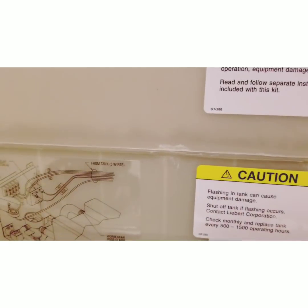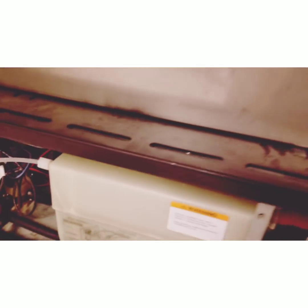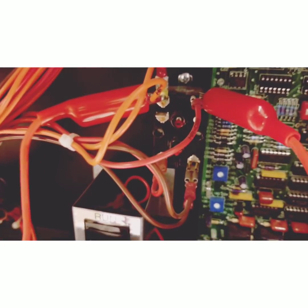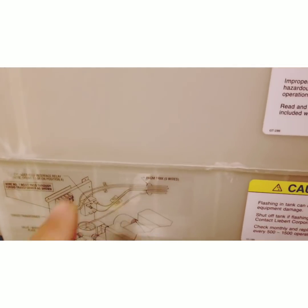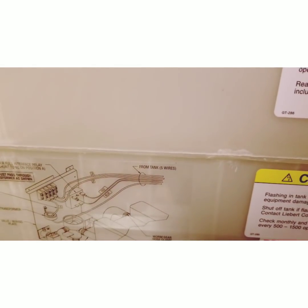Now we're humidifying — we filled up, and you can actually see that water boiling inside. We're going to have to change this relay. I find these little black relays are not very good; they fail quite often and quite easily. So I'm going to drain the tank down to show you how it fills up and the reading we were getting on the meter on the fill valve. The water level will start to drain off slowly — you can kind of see it in there, still bubbling away.